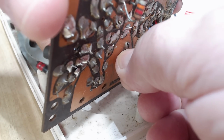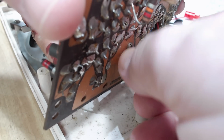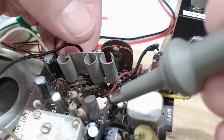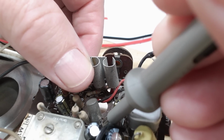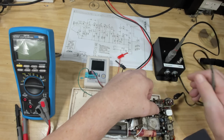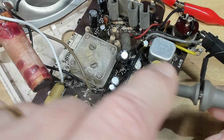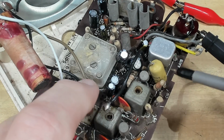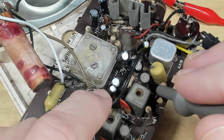See if I can tune it. Nothing there. So the next transistor is that one, it's TR4. There's the base. Whoa, that's working too. I've got to turn that down. Wow. I put a bit of heat shrink over this metal part of the probe here because that's got 9 volts on it. It's because I connected up here somewhere. So, what am I doing? So that transistor worked.